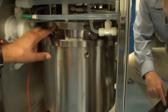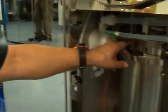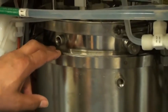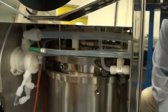These are the tanks. These are heated tanks. They've been pulled out and reconditioned. All the sensors, level sensors, and heater elements have been tested and confirmed as working. All the valve considerations with the tank, as well as throughout the tool, have been taken care of.